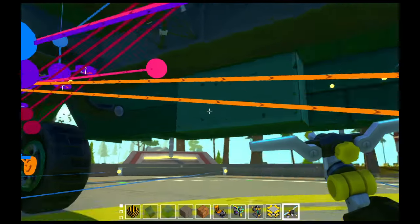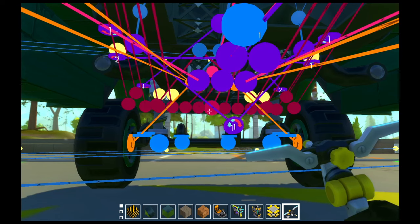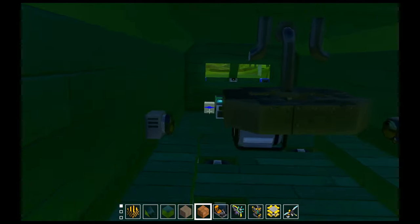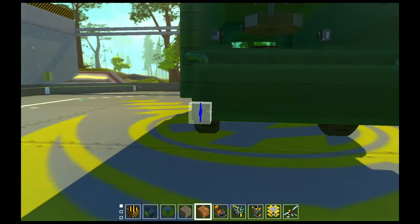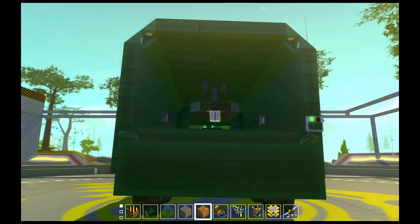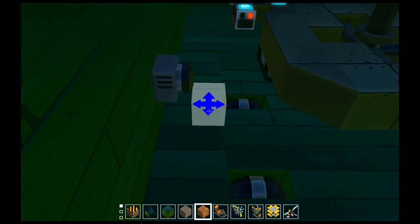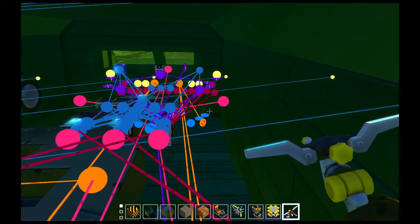But when the gyro activates, you want it to disable these, basically, so that it doesn't fight against them, or else it'll basically just go straight instead of turning into the lean, stopping it from rolling. So the part that's nice about that is, here, I'll block off this sensor. So it's turning right. So imagine it's going up a hill and it's rolling to the right. If it's rolling to the right, this one will be activating. So you can see that one telling it to turn left, but if I go up like this, it switches to that one, which is set up to tell it to go right.